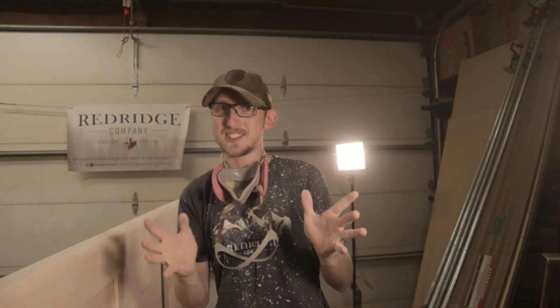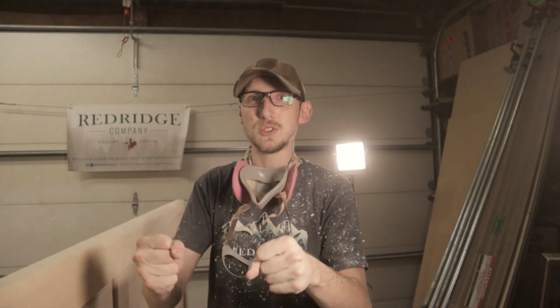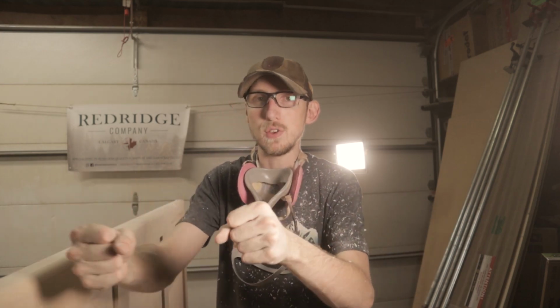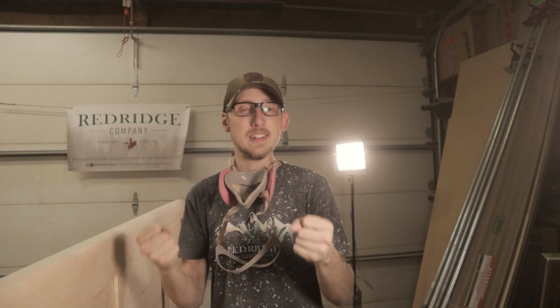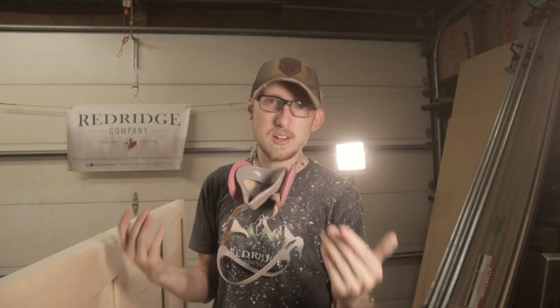So that is probably the biggest thing here. I can't believe I forgot to mention that beforehand. Always, always, always, when you're using the router, always try to pull rather than push. There's going to be some occasions where you do have to push, but in most cases, if you can pull it, that's going to be a decent amount safer. And especially when you're doing something like this where it's already slightly dangerous, definitely take any advantage you could possibly get.